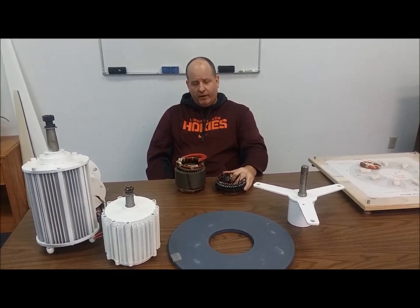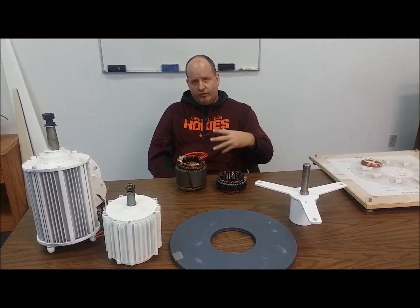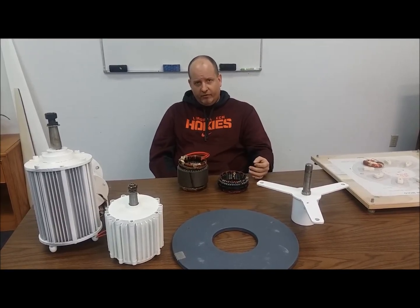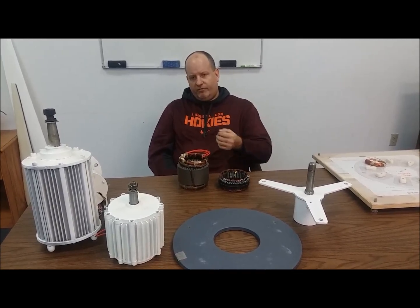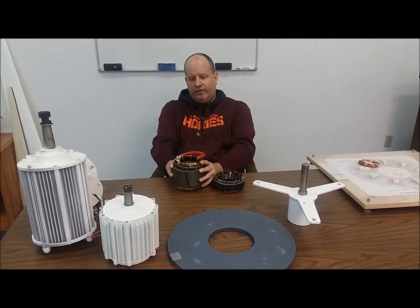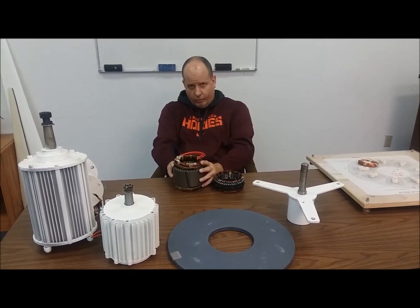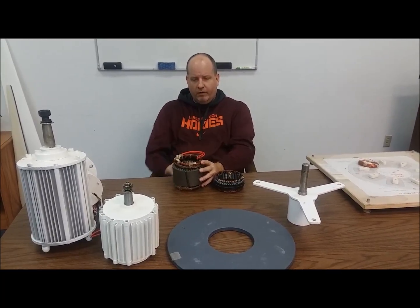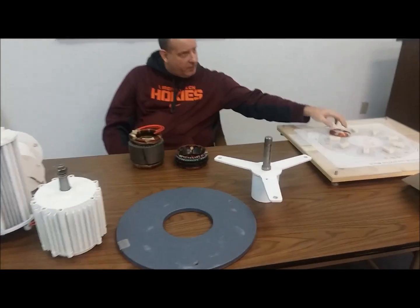The stators in these things are wound with different gauges of wire. The thinner the wire in a stator, the higher voltage you get at lower RPM. The thicker the wire, you have to turn the thing faster but you can get more current. So when you see 12, 24, 48, or 110 volt, it's usually saying that's what you need at a decent RPM — say 150 RPM — to reach a cut-in speed, which is the voltage at which you start producing power.